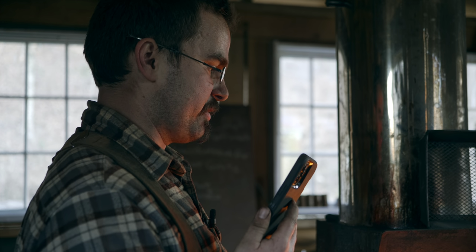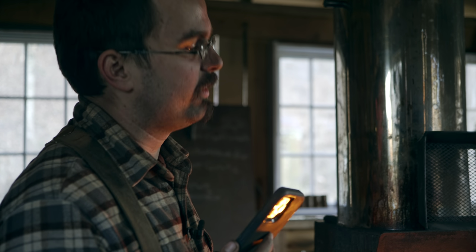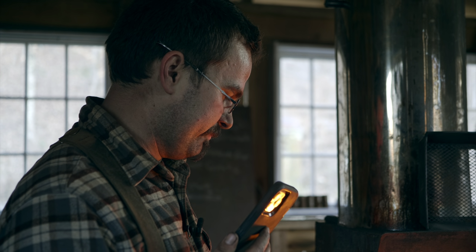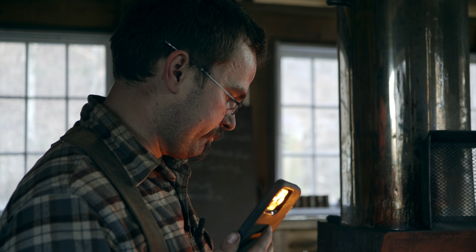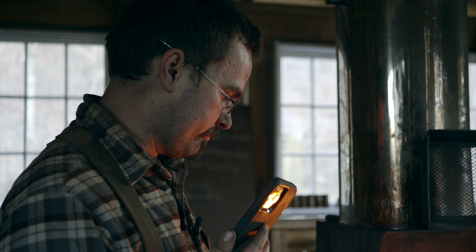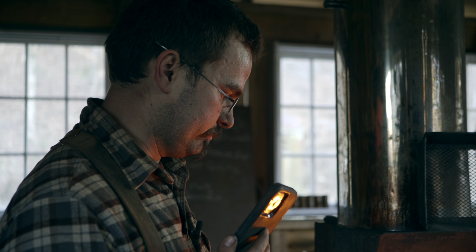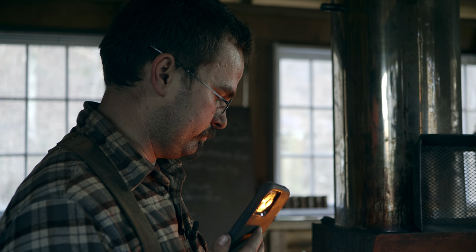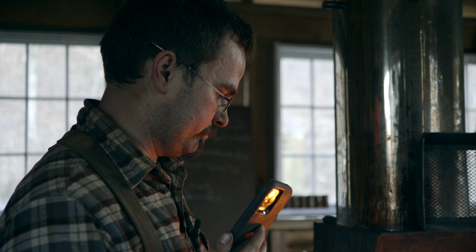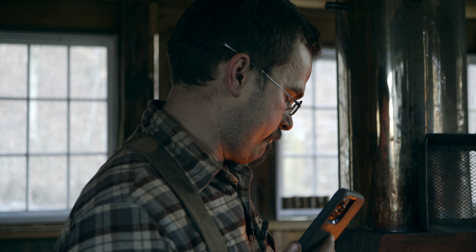I'm open to suggestions. My book that I'm looking at shows some of them angled and some of them square. So you tell me. Well, if it's a straight 90 and it's flush and flat, it's technically a set. Okay. And that's used mostly for facing stone. A pitching chisel is still a 90 square face, but the square is on an angle. You hear what I'm saying? Yeah.